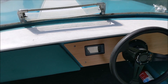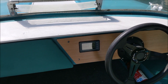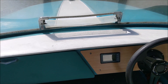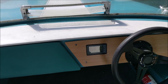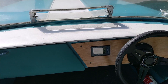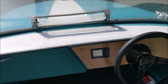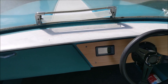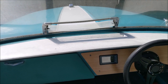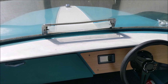Some rough numbers on what we're adding to our battery bank with these solar panels: if we're getting about 6 amp hours per hour going back in, over the course of say five hours in an afternoon, that would be 30 amp hours added back into our tank. Our tank is 150 amp hours if we were to flatten it, which is usually not the case — very often it's still 25 to 50 percent full. So after just a couple days of sitting at the dock collecting sun, we're back full up and always ready to go.